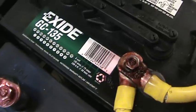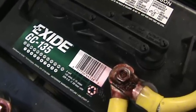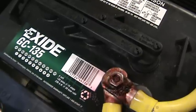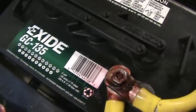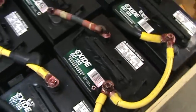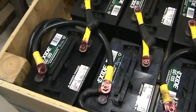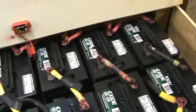Basically all you're going to have on there is amp hours. This is a 225 or 226 amp hour battery. When it just says 226 amp hours, it always means 20 hours. Above that it gives you a little more information — this thing goes at 75 amps discharge for 135 minutes, and that's the full discharge. A true deep cycle battery like these is good for anywhere around 900 to 1,200 discharges depending on how far you discharge them. I only discharge these down to maybe 30 percent.